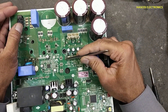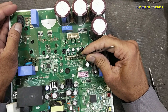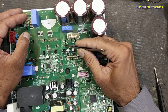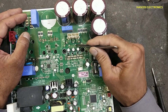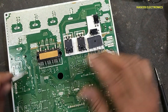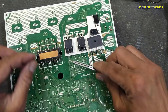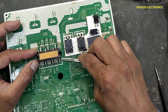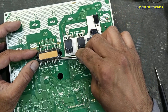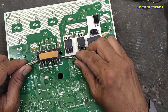We will check all the pins by moving them. If there is any solder remaining, we will desolder it again. We will apply some solder and desolder it once more. Now we will apply very little upward force and monitor the pins. If any pin is stuck, we will retouch it again.